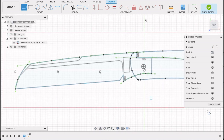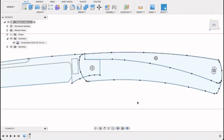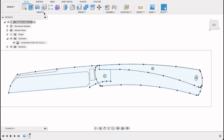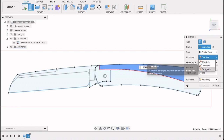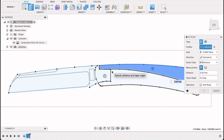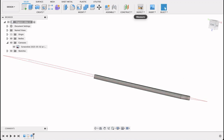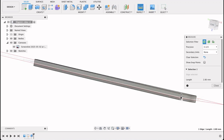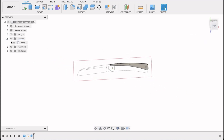There we've got the outline. I'm going to exit the sketch and extrude this — I'll make it 2.8mm thick but I want it symmetric because I'm going to use the top plane as a mirror plane later. So if I've got it symmetric I'll make that 1.4. There is our spring — I'll just measure that: yes, 2.8. I'm going to go into bodies and rename that 'spring' just to help us identify them later.